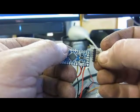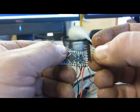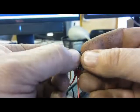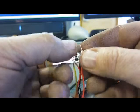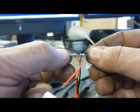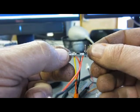We're going to want to put these on so we can program the Arduino. So you want to cut a piece off of the long string that fits just right in here. Just enough in there. And then solder those in place. If we solder them straight up and down like that, it'll be real easy to get the cable on there to program the Arduino.